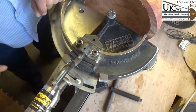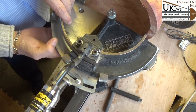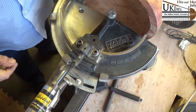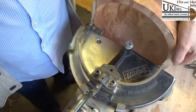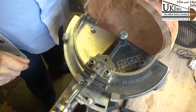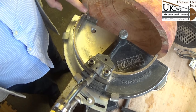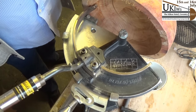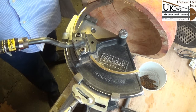This is the piece of equipment — I've set it up roughly on the lathe. It goes on your standard tool rest post. Here's the big blank that I cut the smaller bowl out of. What basically happens is you have that turn around, it's all locked into place nicely, and you've got a lovely curved blade with a sharp tip on the end, and you literally just go in like that and it cuts the core out of the bowl.